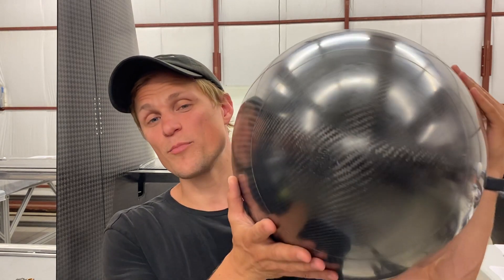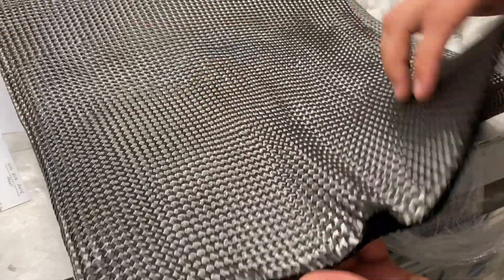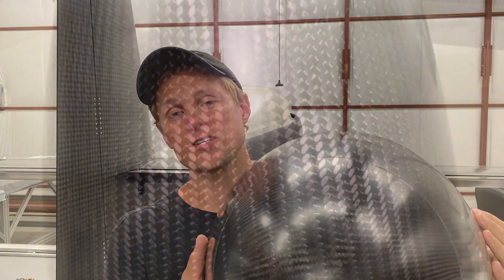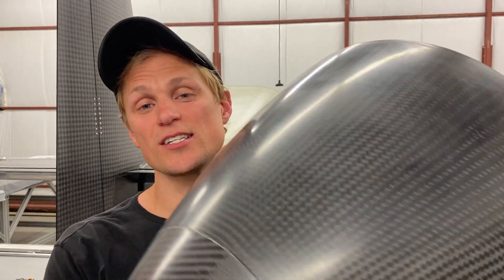There's a variation on the twill weave we use in which the cloth is woven into a cylindrical sleeve. We only use that on one part in the aircraft, which is the spinner. The advantage of having it woven into a sleeve is that there are no axial seams in the cloth, which keeps the weight and strength evenly distributed around the circumference of the part. If this part did have an axial seam, that could create a heavy spot. Since this part rotates with the prop shaft, that heavy spot could cause an imbalance, which would lead to vibration — and we want to minimize any vibration with the propeller and engine. That's why we use a sleeve with no seams.